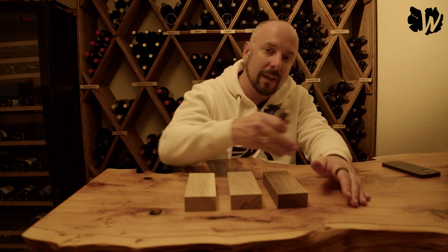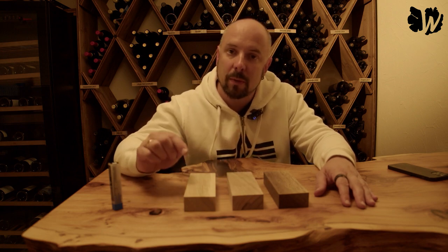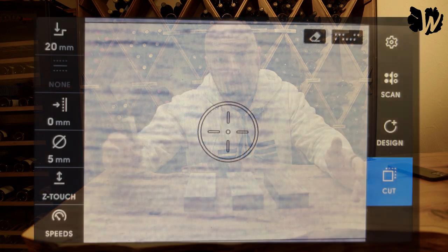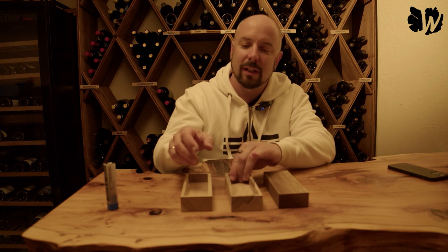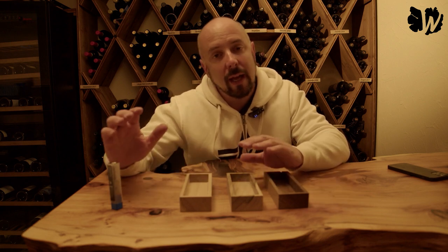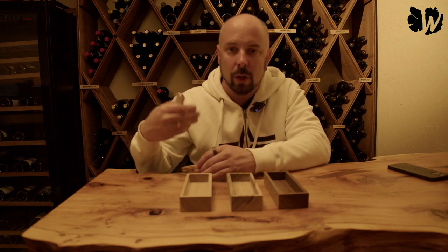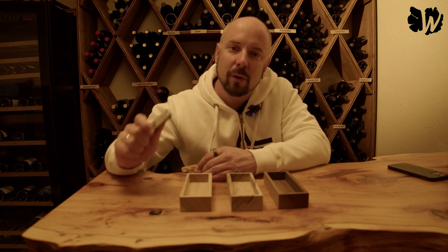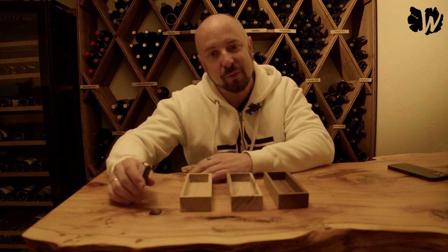I used speed 5 for all three types of wood — it's supposed to be the same. For these three little pieces of wood I would use a pocket cut that is 150 millimeters by 45 millimeters and drill 20 millimeters of depth at once. And I would get those little trays here using this router bit. After each one I will look at the cut quality, how long it took, how easy it was, and also take a photo of the router bit after doing it to see how fried it got.